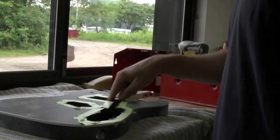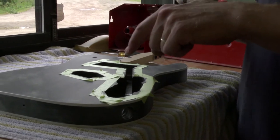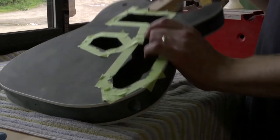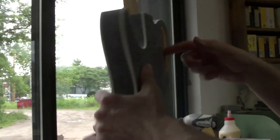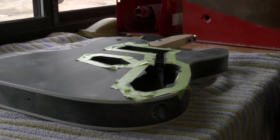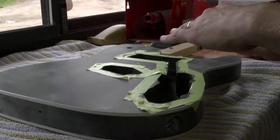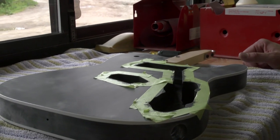I've done a lot of guitars with a lot of wire in them, and that hasn't really been a problem, but the way that this one is arranged, there's just a lot of wire travel back and forth and back and forth up to this kind of unconventional spot for the pickup selector through the back. So using this shielding paint, so it's like a Faraday box. And this has been sanded to, I guess, 400 grit. So I'll bring it up from 400 all the way to 1500 and then polish it.